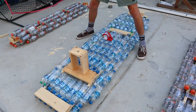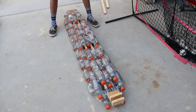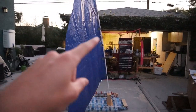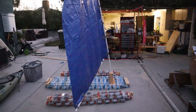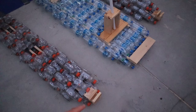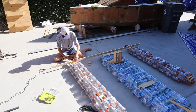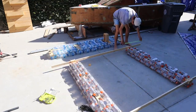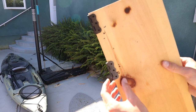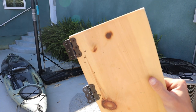Later on in the video, when I test the boat, my friend Sean helps me do some filming, so I want to thank him in advance. She fits pretty well, but you can tell she's bending to the back and the boom isn't secured. In the morning I'm going to add some rope to straighten her out. To finish off the build, I'm figuring out the wooden supports that connect the pontoons to the main flotation area, and I'll quickly make the rudder using some household hinges to allow it to turn. The wooden supports are connected with bolts and nuts, making it much easier to disassemble and transport the boat.